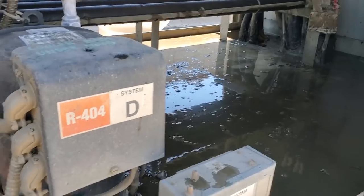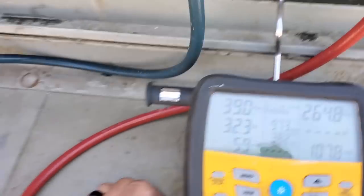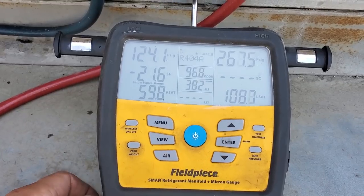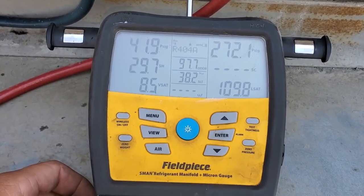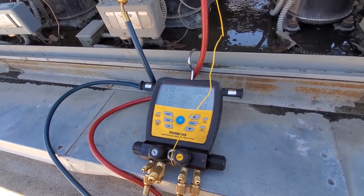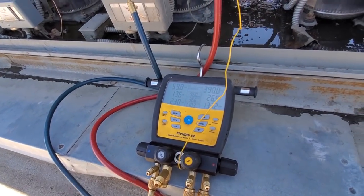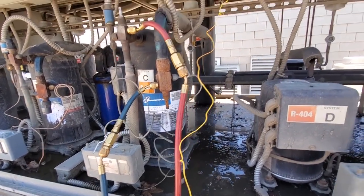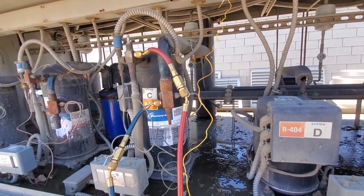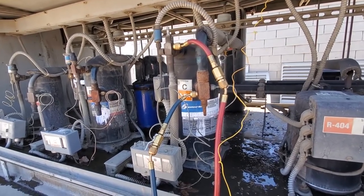So I gave the rack a quick rinse — nothing crazy, just real quick. We actually aren't flashing. Even after I put all that refrigerant back in, we were flashing. So I'm thinking maybe it was going off on bypass just because the rack was dirty. I'm going to go ahead and clear the sight glass and then add the remaining refrigerant for the winter charge and then finish diagnosing. There's like one thing after another here. So this thing keeps going off on bypass — it keeps internally bypassing the high side and equalizing with the suction side. And this is an original 2004 compressor.